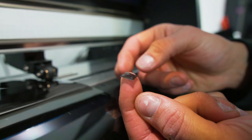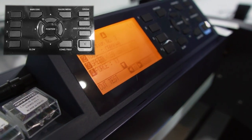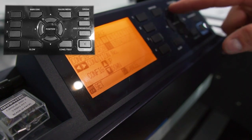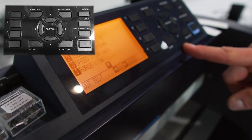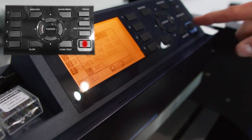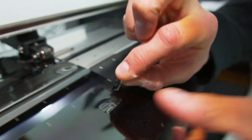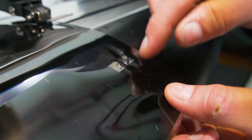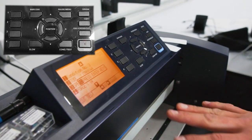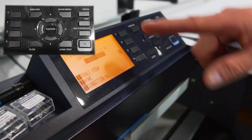We can see we still have the triangle in there. So I'll come back to the controls, press enter, and turn the force — number four — up to 14. Press enter. I just increased the force by one. I'll do another cut test: left arrow, enter key. It separated. That is deep enough because any further I can see a little indentation in the clear and we may start going through. So we're good. Let's hit condition to exit and I'm going to move the film forward slightly because we cut those little triangles down there — if I don't move it forward, we'll cut on the release liner rather than the tint.